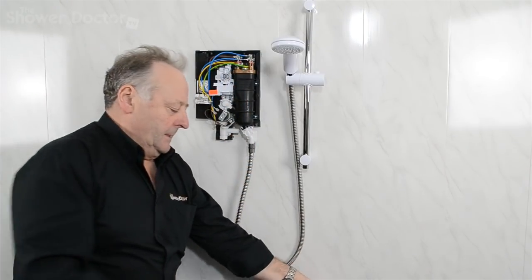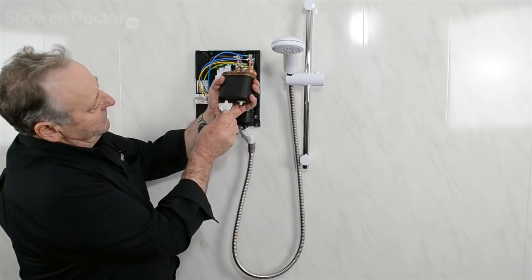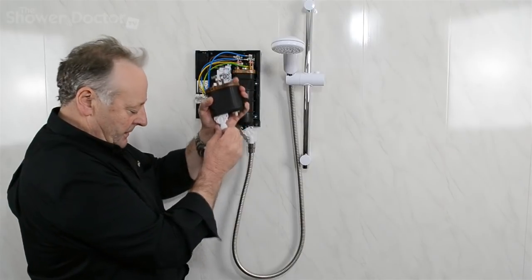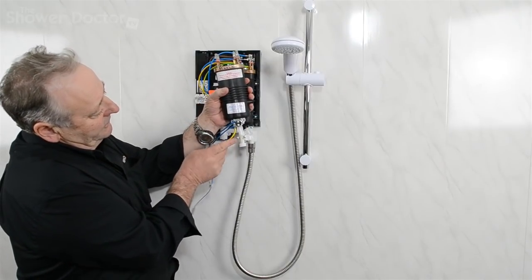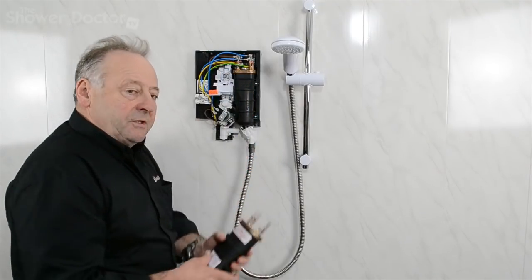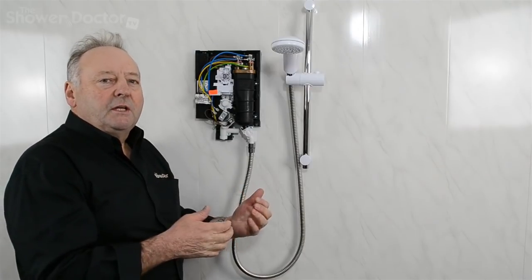Triton has various methods of putting this on. This is another one. This is slightly different in that the outlet pipe, which would fit here, doesn't actually hold the pressure relief device in place in this case. The way this sits into the casting of the shower, the pressure relief device is held in by the casting. One of the other Triton pressure relief devices is this vent one here — it's really just a case of unscrewing it from the front and screwing the new one into place. Once again, it's a ball inside that just blows the ball out. Most Triton pressure relief devices are fairly easy to repair. It's the sort of thing that would go wrong occasionally, so it's almost a DIY job.